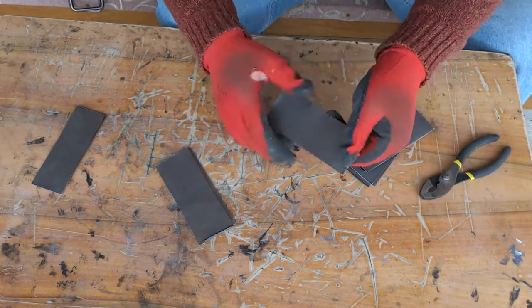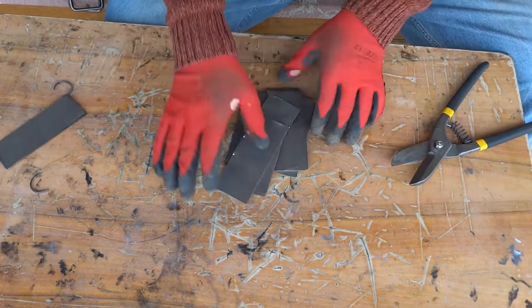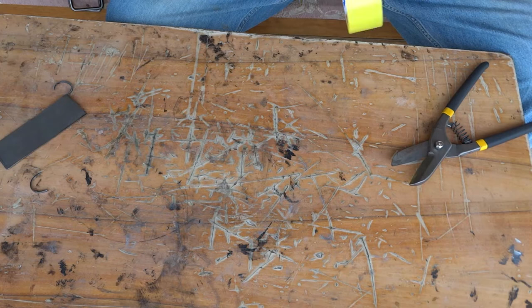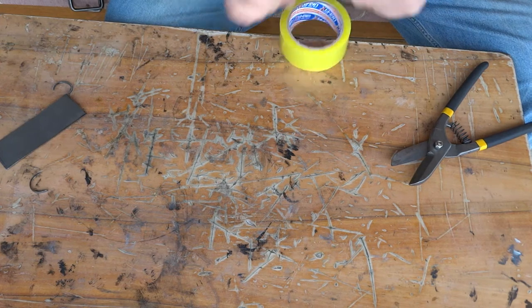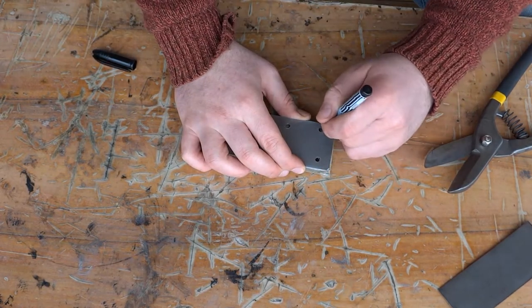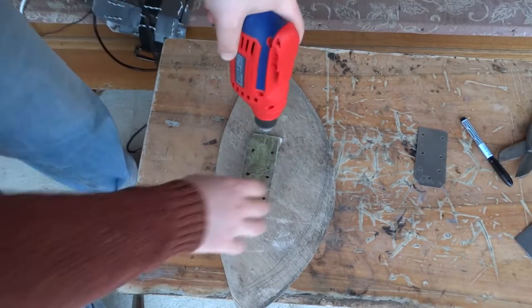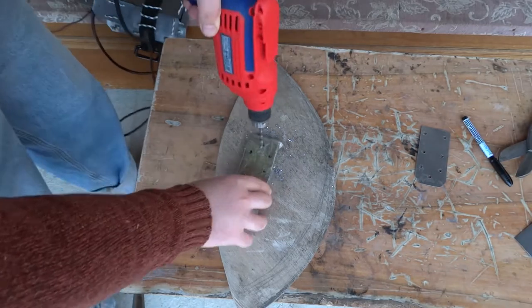After flattening the plates, I use a technique I made up: I wrap the plates up in duct tape so I can later drill all the holes into them at once. Drilling holes individually would take a lot of time and effort. This way I can make more consistent plates and more of them at the same time. It saves effort in aligning them — if I made them one by one, the holes might not align as well.